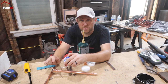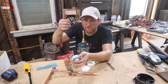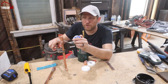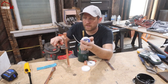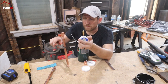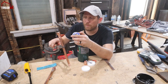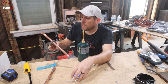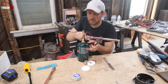And it actually happens also upwards. So if you ever do a fitting where, for example, you have a pipe standing like this, and you have a joint that you need to add, even if you do it like this, the capillary action, the function in physics, if you have paid attention there, will actually pull upwards too with the flux. So I'll show you guys. It's actually pretty quick and doesn't take very long.